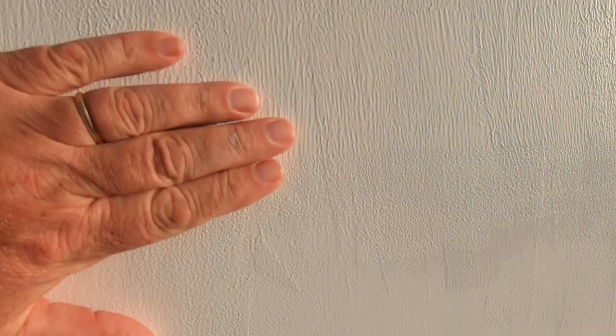this is going to be a good example because you can really see how rough this is. There's a lot of people that will only spray gel coat, and that's fine. I understand that because if you have the facility where you can spray, it's a lot easier. You're spraying on a smooth coat to start with. You're not getting this where it almost looks like it was put on with a spoon. But the bottom line is that if you don't have the ability to spray on gel coat, you can practically put it on with a spoon and we'll get this thing smooth, hopefully without burning through again. But we put some good coats on here, so we'll see what happens.